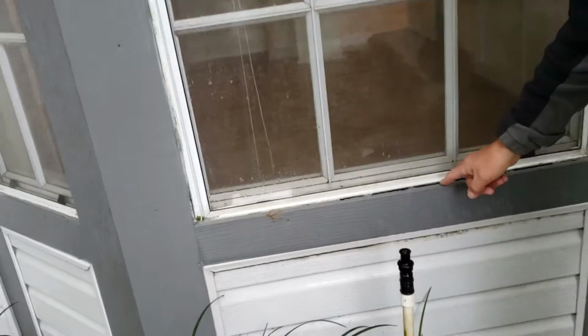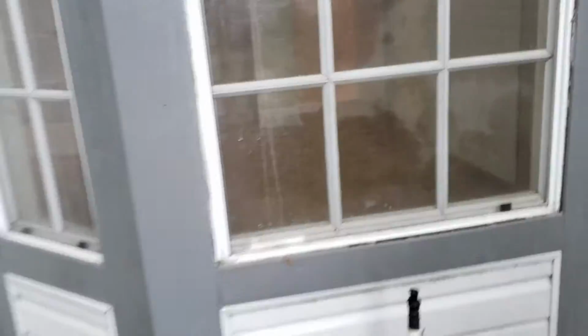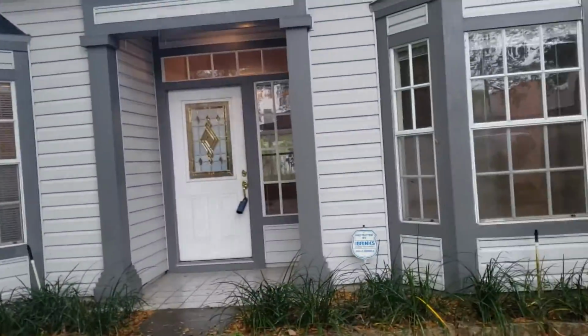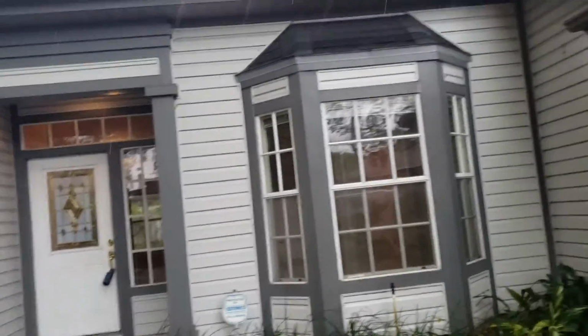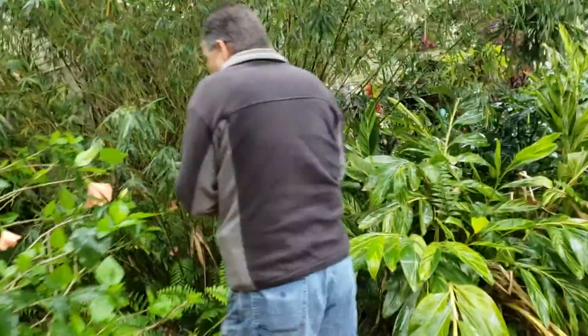However, the window trim is all metal. And this window here, you can see how it's pulled away. Some of the wood back here is water damaged right now. And there's a window in the back of the property that has the same problem. So the metal trim needs to be secured and caulked in, and then you'll solve those problems. But there's no water penetrating the house? There's a little bit. It's damaged a little bit of the board behind. So it's coming in through that.